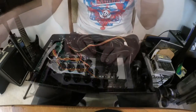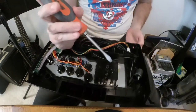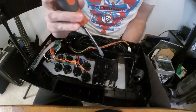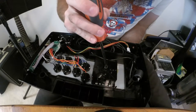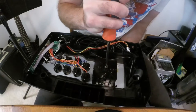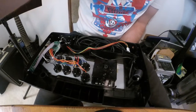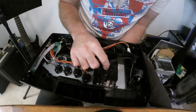Next we need to remove the ball top. You will see a slot in the bottom of the joystick shaft — use your flathead screwdriver there, and then reach under the fight stick to grab the ball top. Here is something very important to note: when unscrewing the ball top, do not turn the shaft. Turn the ball top to avoid any damage.